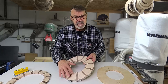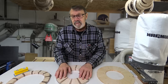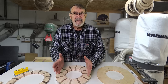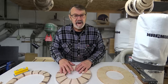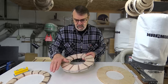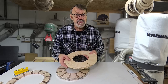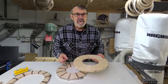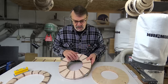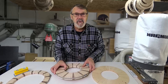So now I've got it dialed in and I can make these perfectly. What I'm going to do is not glue it up in one piece or even as half rings, because it's not working. I'm going to do it in four quadrants. I found when I glued this one up, even using Titebond 3 — which has a long open time — it was drying up and I couldn't get it to clamp up properly. So because of how many segments there are, I'm going to do it in four quadrants and we'll see how that works out.